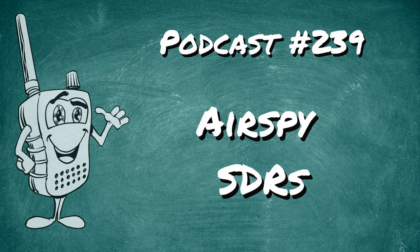It's not just AirSpy devices that the Spy Verter will work with — it'll work with basically anything you want to power through it. If you don't have a bias T, you can always use the micro USB adapter that comes with it to send 5 volts to the Spy Verter so that you can use it with something like an RTL-SDR, a Nooelec, a HackRF, or anything else. To set up your chain: plug your SDR into your computer, plug the Spy Verter into the antenna port of your SDR, and then your antenna goes into the back of the Spy Verter.